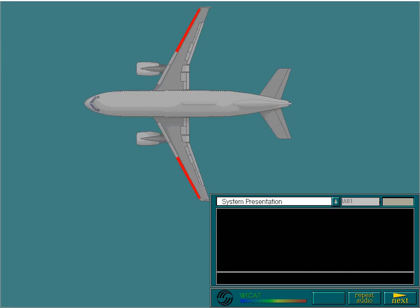The leading edge of the outer slats and half of the centre slats of each wing can be heated to provide ice protection for the wings. Hot air is used for heating these areas. This hot air can come from the engines or the APU, up to 20,000 feet.